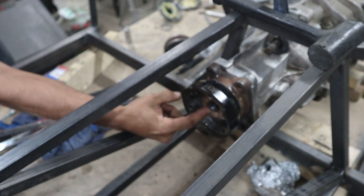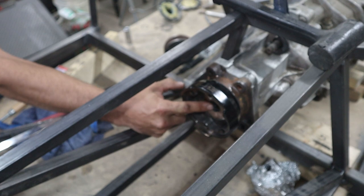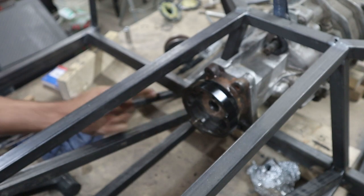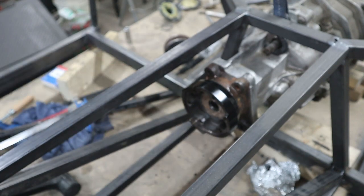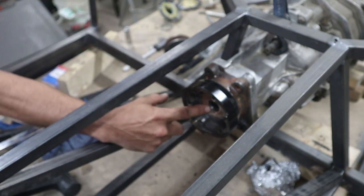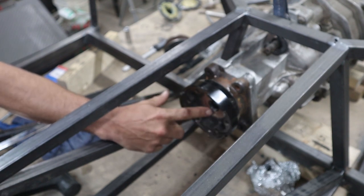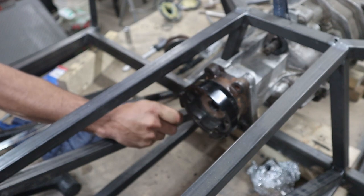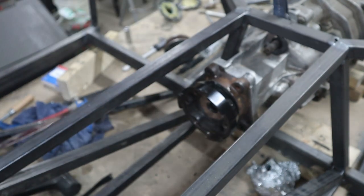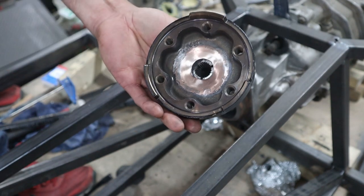And measure my distance to there, to the inner sleeve, so that I can weld that on the bench. Okay, and that's really, really close to where I measured it, so let's see where it's actually at. So now, when I pull it all apart, I can weld that inner sleeve to this hub, to the adapter, and just make sure I'm set to that depth, maybe a mil or two short of that as well. So just got to set the depth to there.